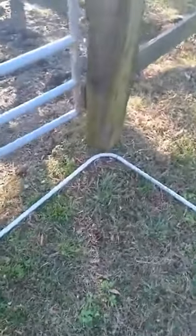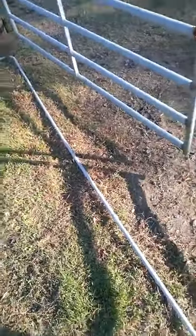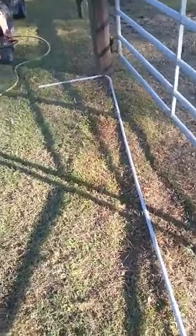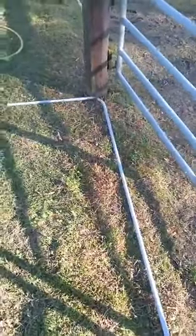All right. What I'm going to do is burn a trench into the ground, and after I cut through the top of the grass mat, I'm going to take the bush axe and trim the grass out. Then I can burn it on down about as deep as I want to go, and it leaves a mud slurry. Once I get the slurry deep enough all the way down, we'll push the PVC down and lay the trench back over it. The ideal thing is like we did at the other barn and fill it back in with some screenings, but I'm in a hurry today.